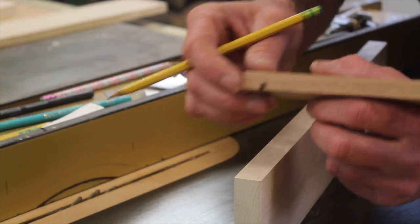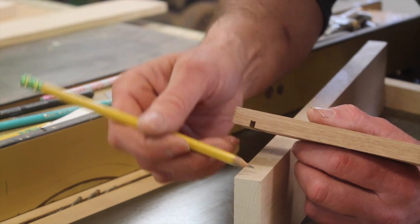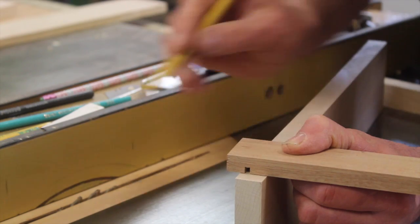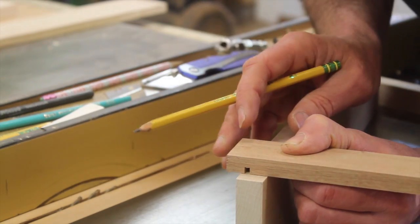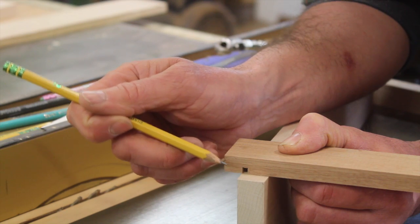This is the back of the drawer. The next step is to cut a dado in the drawer sides to accept the back. I'm working with a piece of scrap wood to sneak up on this measurement. The first step is to set the fence at half an inch, and I've set the blade height just around 3/16ths of an inch. I'll make this cut in all four drawer sides.